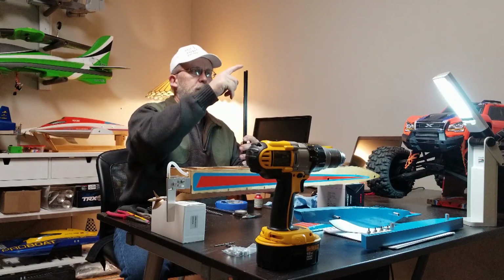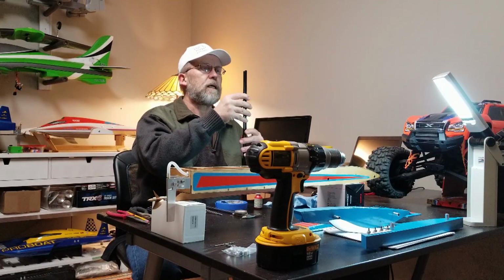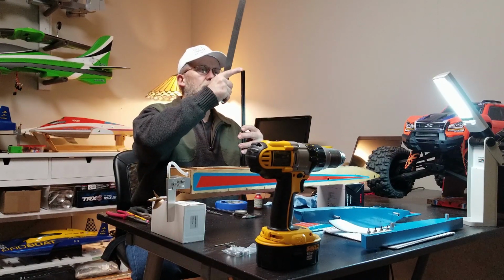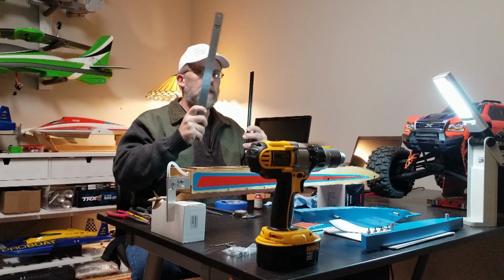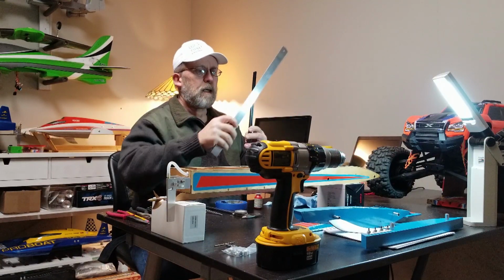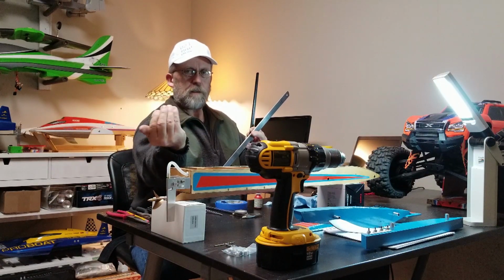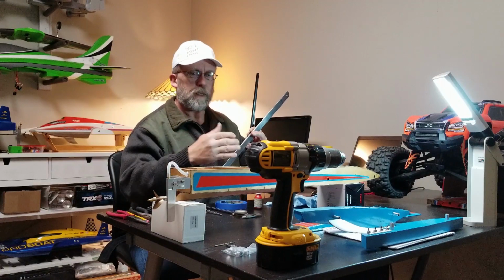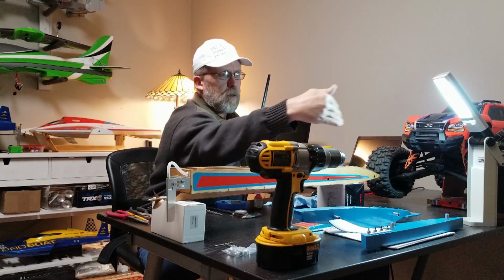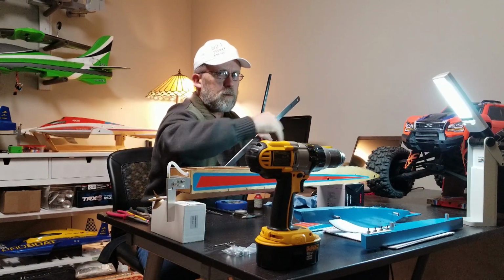According to Zippkits instructions, and they say they know what they're doing, if you have any questions, feel free to contact them about how to tune their riggers. But according to their instructions, we need an 1/8 to a 3/16 toe in on the right sponson. And that's to offset the drag from the fin. Instead of making a rudder trim adjustment, which would add drag, with the tendency of the fin all the way out there pulling through the water, a little toe in, it'll run straight.